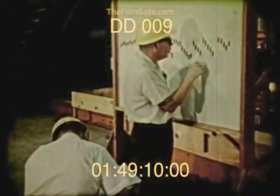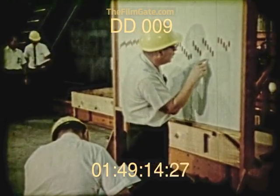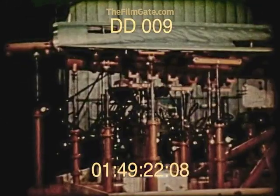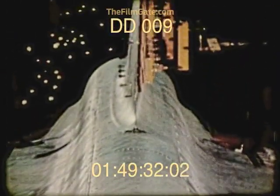Sixteen different modes were used in the static test, from maneuvering speeds up to Mach 3.3 free flight conditions. Gauges measured the deflections of the structures of the combination during pushovers, pull-ups, engine out, and hatch jettison conditions, as well as loadings on the nose bearing, spike, engine, and rudder. The drone airframe sustained the design ultimate load for all the conditions in the static test.